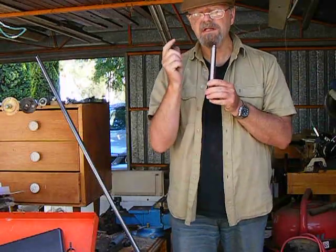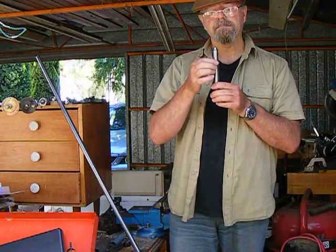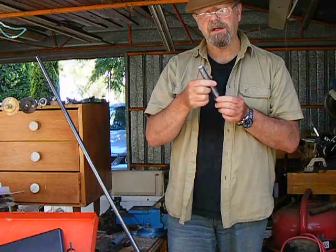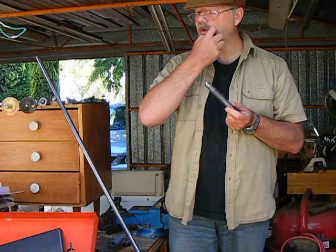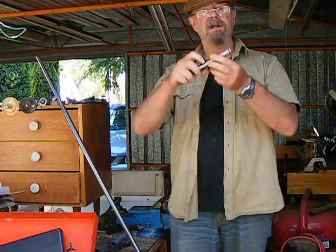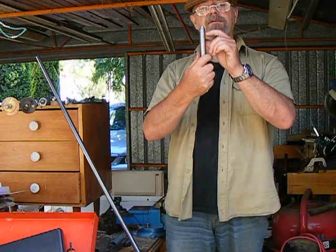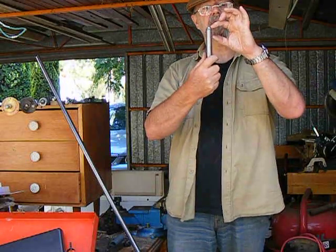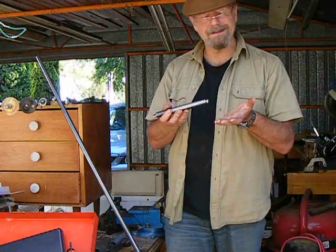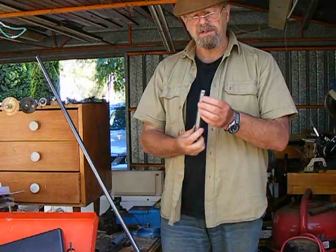The end of the tube has to be turned down a little because that tube is 19.025mm on average — it's a manufactured tube and it varies a little. The inside of the sleeve is 19mm exact on all ones I've measured. So that would be a press fit if you put it in there, very hard to get in, so you machine that down. You can do it with a hand grinder. I'll show you a bit later — turn that down to 18.5mm in diameter for the last 30mm of the tool. Then it fits nicely into the body of the sleeve. You want a bit of slop when you put it in, because you don't go in perfectly straight. But it's important that those dogs must be 21.5mm.